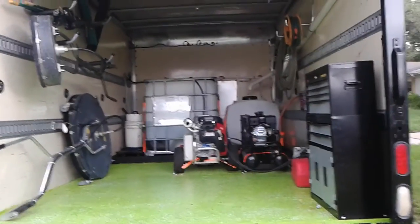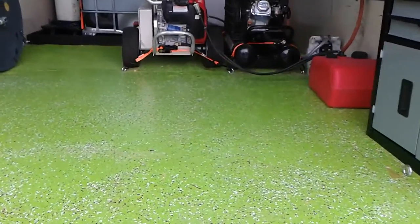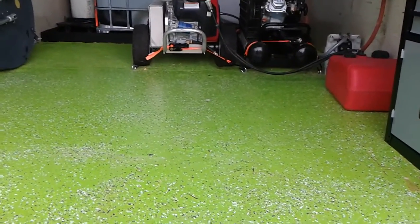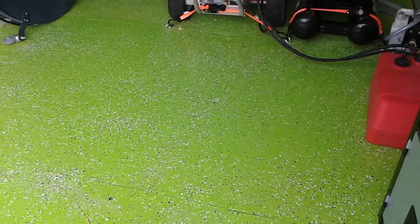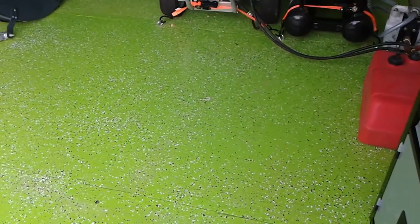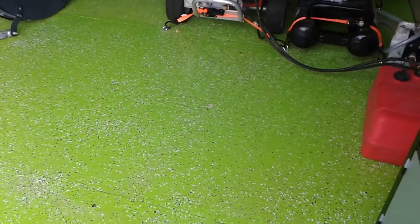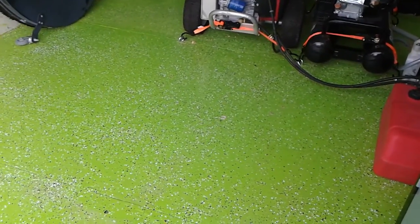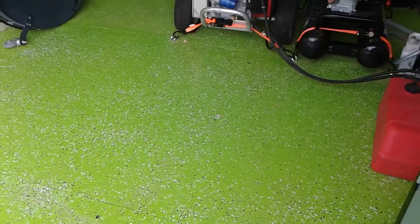Here you can see how we have our truck set up — this is all the equipment needed. Starting with the flooring: we put an epoxy coating down, the kind you'd typically find in garage floors. The benefit of this epoxy coating is that if a hose breaks or blows — which is common — and water gets into the wood, with bare wood you risk it rotting over time. With this epoxy, water cannot penetrate in there. I also added a non-slip additive — the same one we use for brick pavers — so if it's wet or our shoes are wet from working, we're not going to slip. It's good for the employees as well.